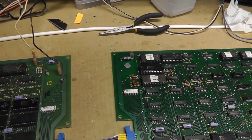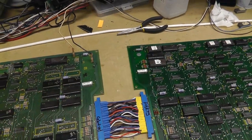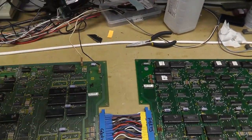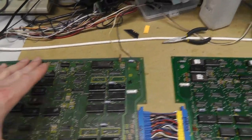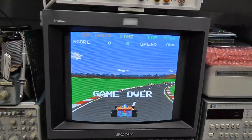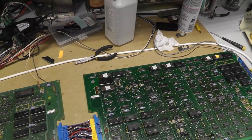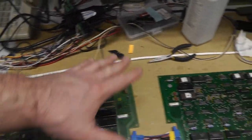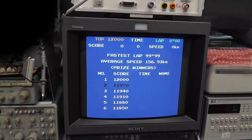Wait a little bit — power on and it boots right up, no problems. I do need to eventually do something better with my edge connector — I had to desolder one side and re-solder it, a pin slipped out and I had to futz with it, so it's a bit flaky. But that's it: CPU board done yesterday, video board done today. Thanks for watching — Pole Position is a lot easier when you have working boards to swap from. On to more disastrous ones next week — a couple with a ton of battery damage, really filthy boards. Cheers!